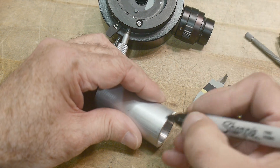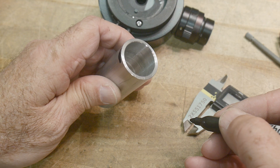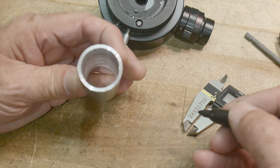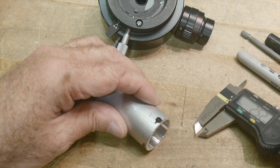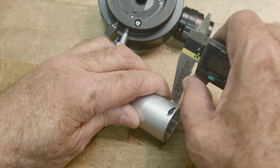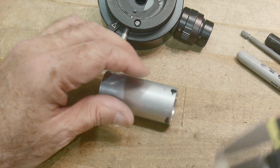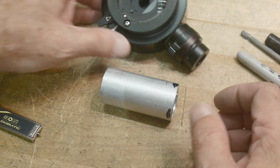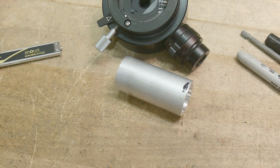Let's put some black on here. Do I need 2 holes for now or just 1? I think it's better to have 2, maybe 90 degrees apart. So let's mark that. I'll probably use a 4-40 set screw. Let me put some holes in here and put some set screws in.